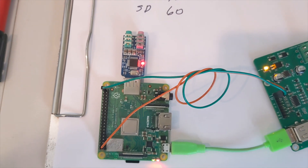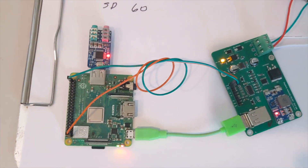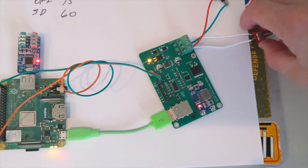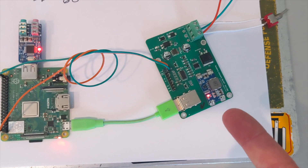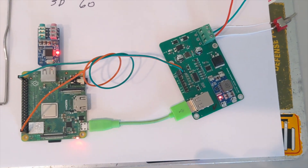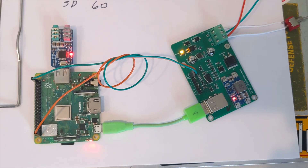You should see the light up when it gets booted. There it is — now the Pi is booting up. Like I said before, if I was to come over here and turn the ignition off, it's still going to continue to boot and continue to be powered. That's to keep you from any type of corruption. If I turn the ignition back on, the timers start over.